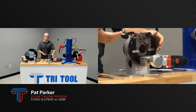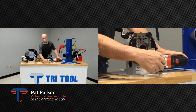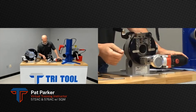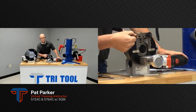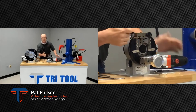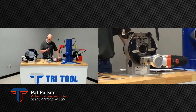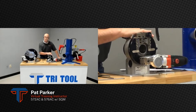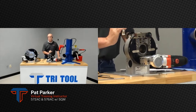You don't have to deburr if you manage the feed rate. On the knob, as it's rotating you can hold it and let it go and slip it a little bit, or turn it, and you get a light feed so it doesn't create a burr. The feed rate is adjustable axially from zero to five thousandths for stainless and Inconel — most of the time we're running about three thousandths per revolution. This machine does one-eighth inch through one inch on pipe and quarter inch through two inch on tube, up to 0.125 inch wall.